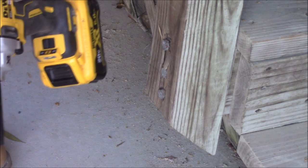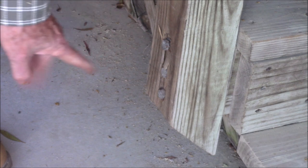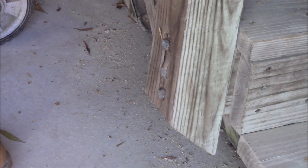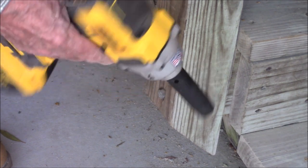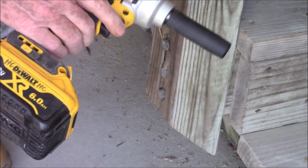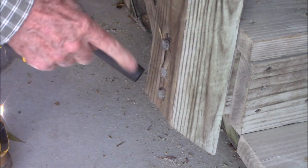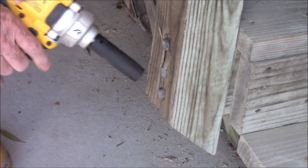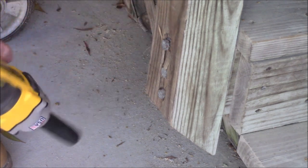This is actually how these rails are installed. There's no notch here, and you put lag bolts in just like they did. Now, if you use these big 9/16 inch lag bolts, and you don't want to use a socket wrench, you can use an impact driver like this. But the takeaway is, if you do, you need to get some of these black sockets, because this thing will light up your life and it'll tear up those silver sockets right quick.